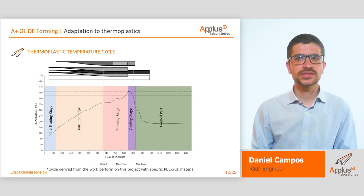Each one of the stages has its design adjusted to the temperature needs of the material. For instance, interlaminar slippage is present while the material's temperature is under 320 degrees. This means our transition must be done before this temperature is reached inside the part. Moreover, the forming effector must allow the material to reach a temperature between 380 and 400 degrees in order to melt all the crystals before cooling down the part. We also have to take into consideration the forming speed and the part thickness while designing the nozzles.